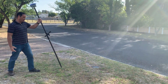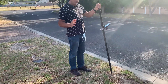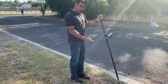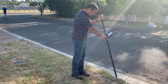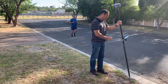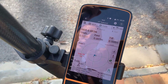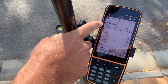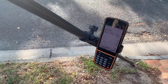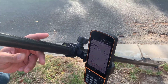The pole is not plumb and I'm just going to walk back towards the point. There's the first beep telling us we're within half a meter of the point. As I go and put my point closer, you can see it's fairly close to the spot. I'm on it now and I'm tilted — you can see the accuracy in this tilted state is currently two centimeters. I'm bringing it down, getting out of the way of satellite perception, and the accuracy is still pretty good. We're now almost horizontal.